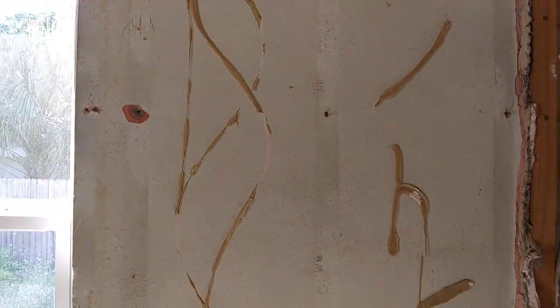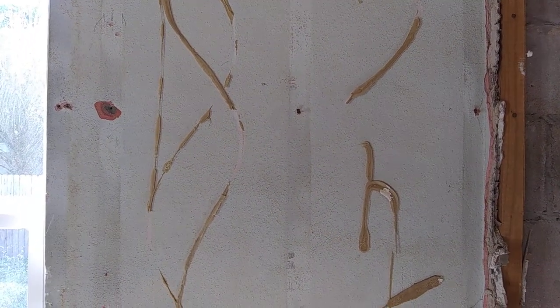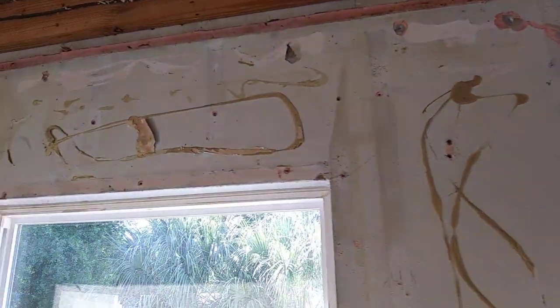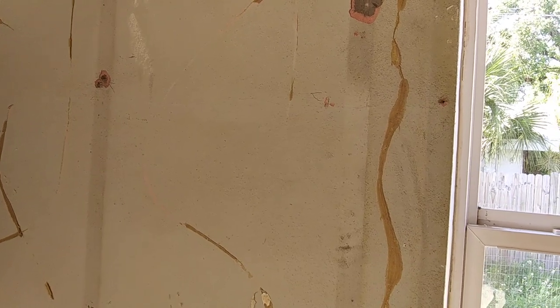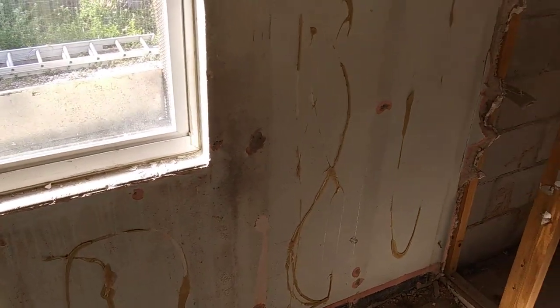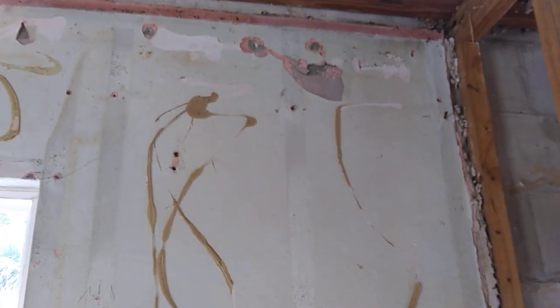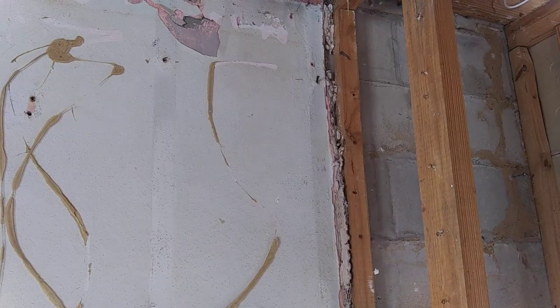So basically, I just wanted to show you what happens when you put drywall onto a wall that has been painted with acrylic paint on top of a lime-washed surface. This is something you should never do. If you have a house that has been lime washed and you still have lime wash on that wall, please allow it to breathe. Remove drywall, remove acrylic paint if there is any. If there's no acrylic paint, you are really lucky — just remove the drywall and let that wall breathe. All of this plaster we now have to remove, every single inch.